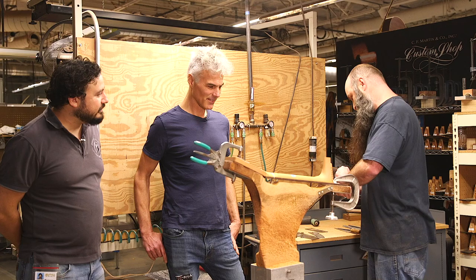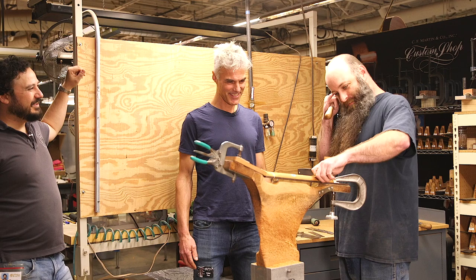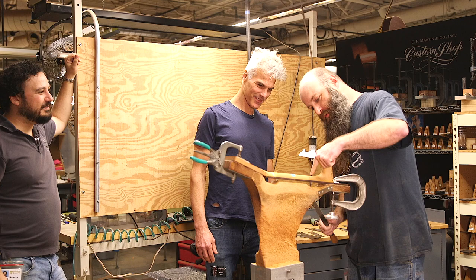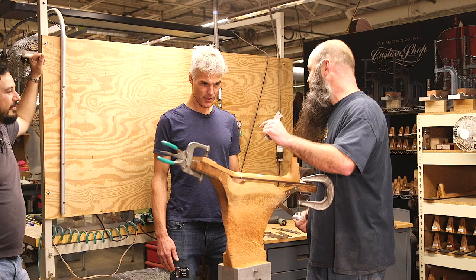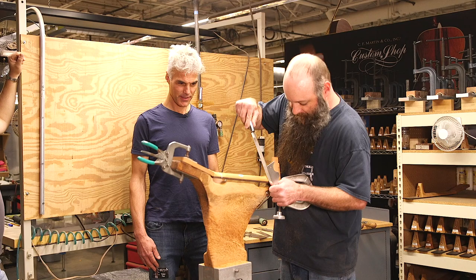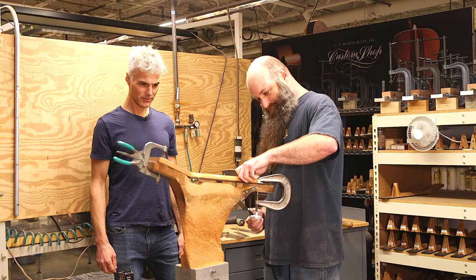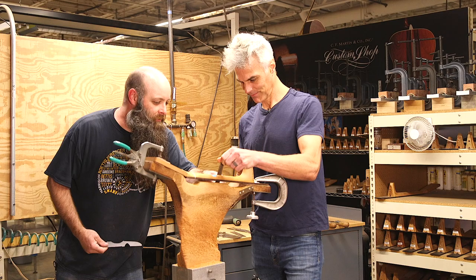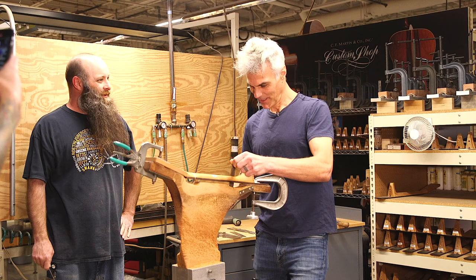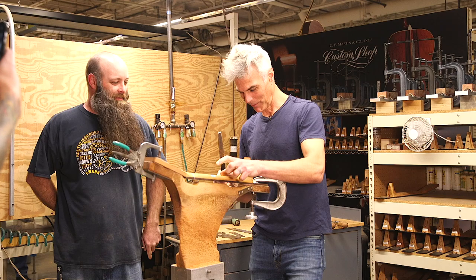Now it's going to be your turn. Oh boy. You ready, John? No, I am not. We kind of sprung this on John a little bit. Mike's going to cheat for him — scribing the gauge marks where the little indents are. Just take your file and go forward like that, right in that area. You only want about an inch or two area, and on this side you want to go down. Remember, it only cuts in one direction — on the push, not the pull. On the pull you're just coming back to position. This is way scarier than shop class. Mike makes it look a lot easier — we realize that today.